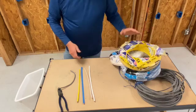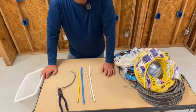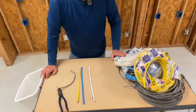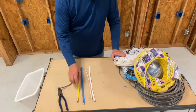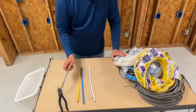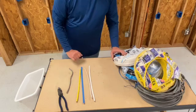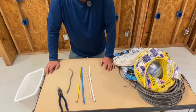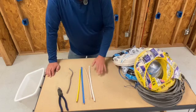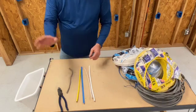So guys, just take a little bit of time and prepare yourself for what you need before you get to the store, because it gets overwhelming. When we get into that electrical aisle, our brains just go crazy. So one more time: 12 is good for 20 amps, 14 is 15 amps, and we also have UF for underground. Take that into consideration next time you're doing your DIY projects or your honeydews around the house. Have your list already — don't get caught up with the other stuff.